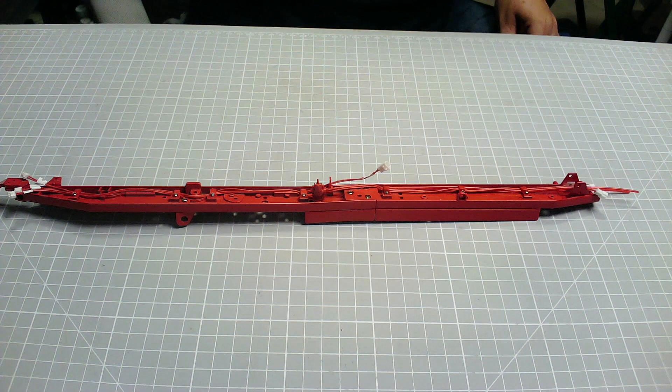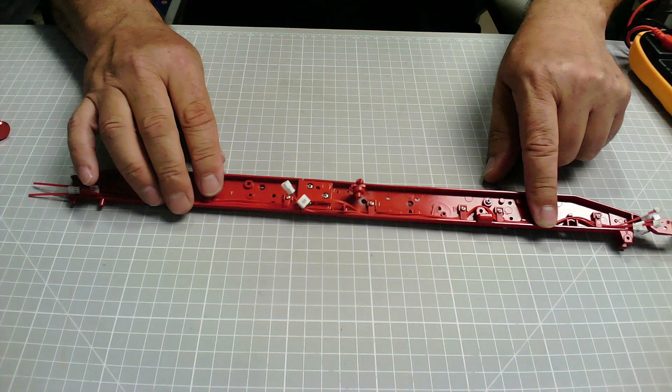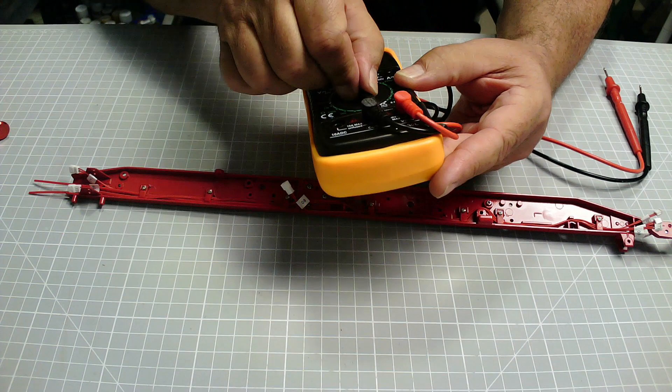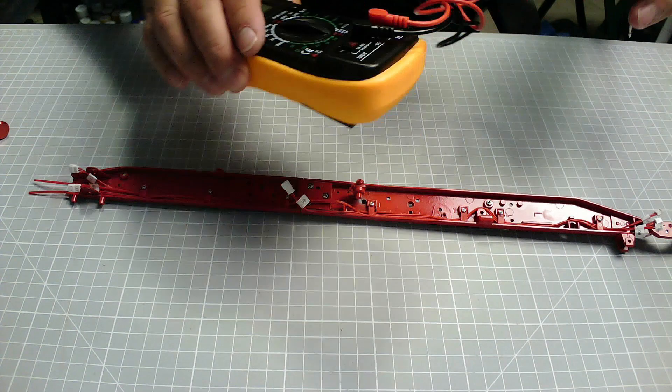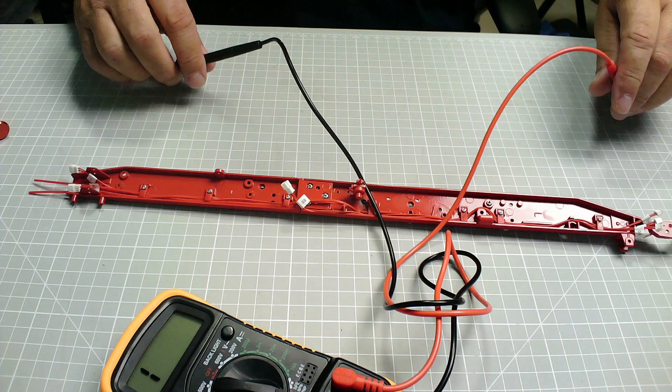Fantastic, that's issue 49 complete. One to go. If you've any concern about the wiring, if you've nipped it at any point you can always check the continuity from one end to the other with a little multimeter. You just need the diode range setting — it basically bleeps. That'll tell you you've got a nice clear circuit between one end and the other.